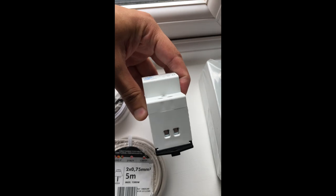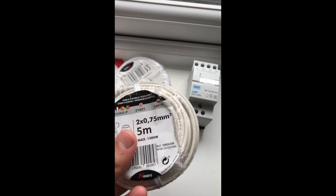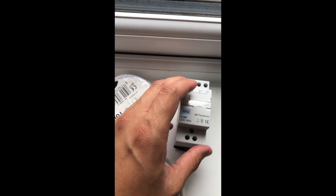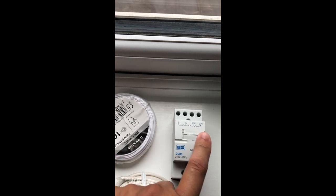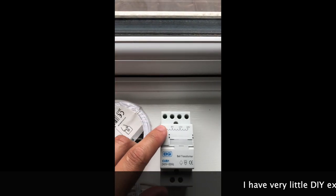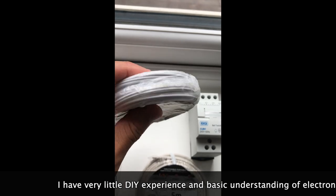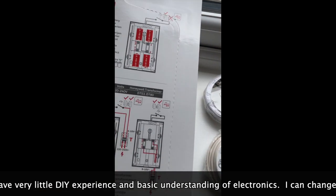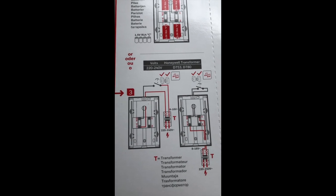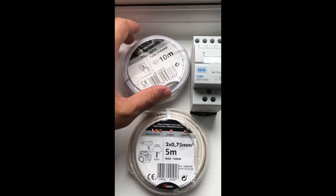The mains connection comes in through the bottom using two-core wire. You can use a plug on the other end or fit it directly into the mains. The Nest doorbell works on 12 to 24 volts, so I'll be using terminals 0 and 3 for 12 volts. The doorbell chime operates at 8 to 16 volts, so 12 volts is safe as suggested on their website — I'll leave a link to the specifications.